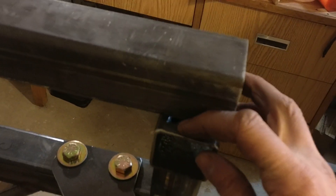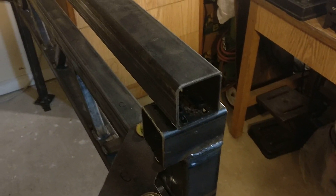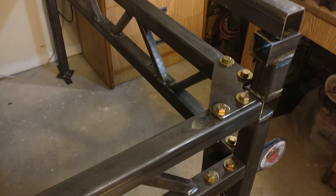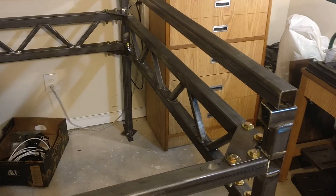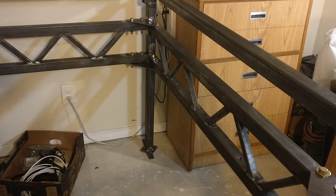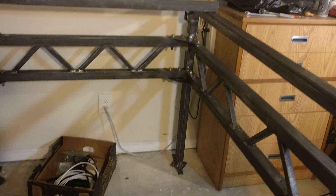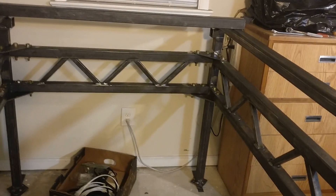The slots here are a little bit sloppy because I did not spend enough time jigging that up well, and that turned out to be one major pain in the ass. The standoffs went pretty well, but when I reset it to fit the longer work pieces for these axes, I made it too thin. Then I had to hit it with the grinder, then the file — take your time, set it up. Maybe do a test piece too. If you have some scrap around, do a test before you cut everything and find out you did it too small, because it will save you potentially an hour of filing by hand.